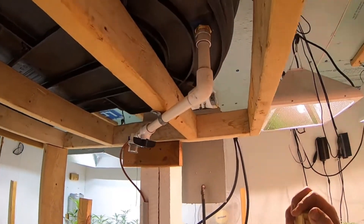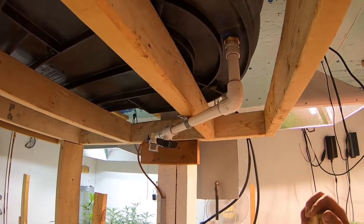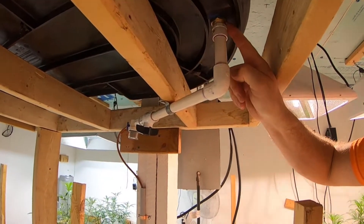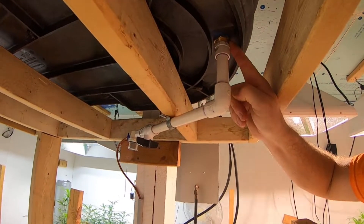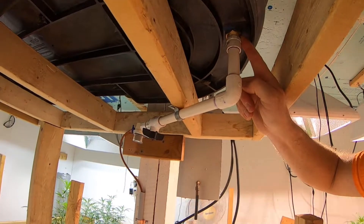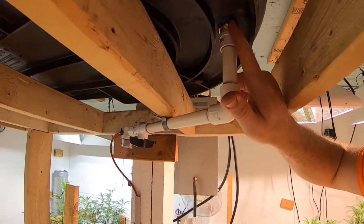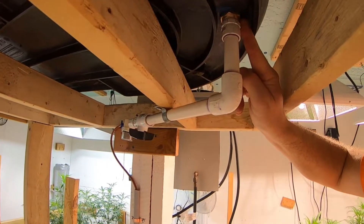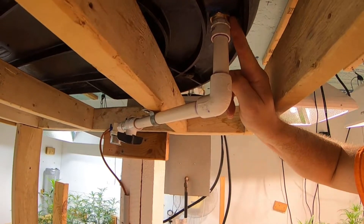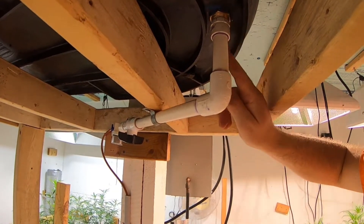I ordered from Sustainable Village — that's the website where I got all my blue mat stuff. I got this brass fitting to go into the bottom of the stock tank where you drill a hole. I like the brass way better than the plastic because you can get it actually tight. I use blue RTV silicone and let it set up for at least a day before putting any water in it.